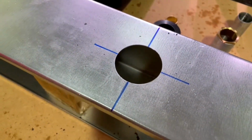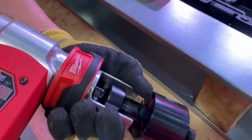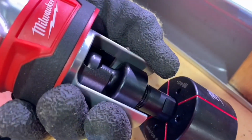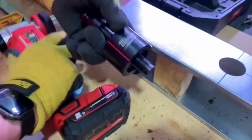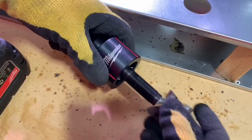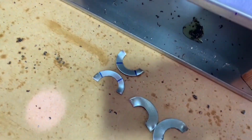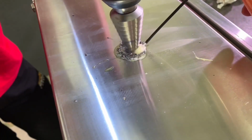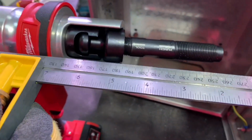So again, same procedure in terms of removing the material we've just cut out, just release the mechanism, and it just pops out. That ball attachment is really good. So I'll just swivel the cutting die out. Yeah, and you see the lines as well, I like that, that's really good. One thing people say is, can it be stainless steel? Yeah, so the most difficult bit about the stainless steel is drilling the pilot hole.